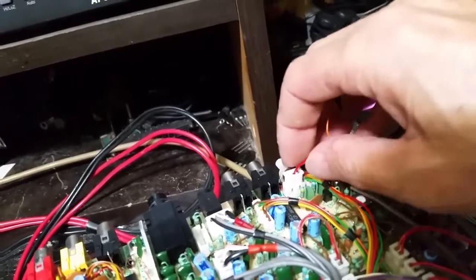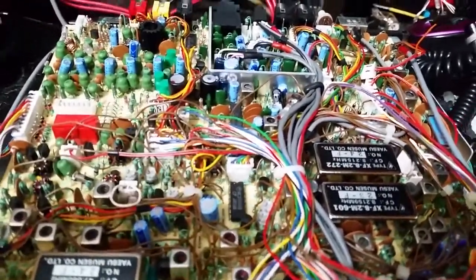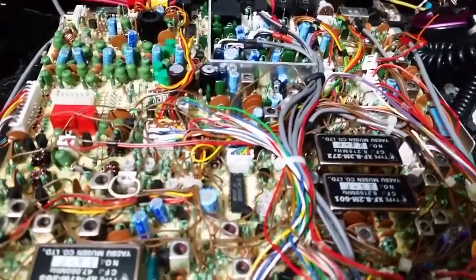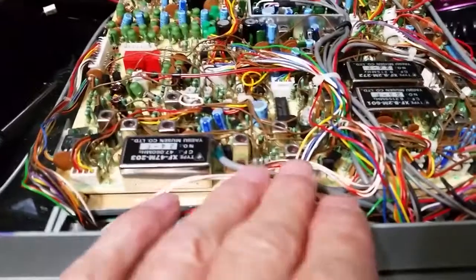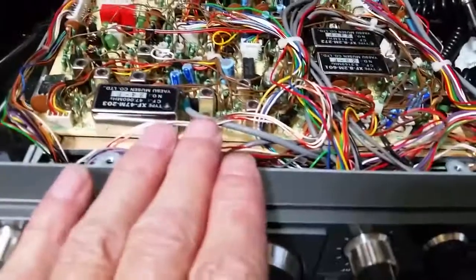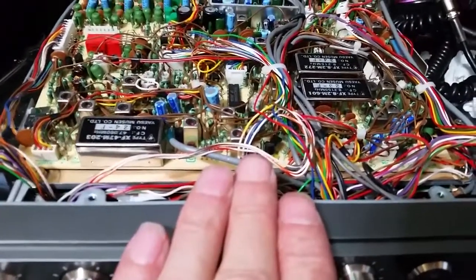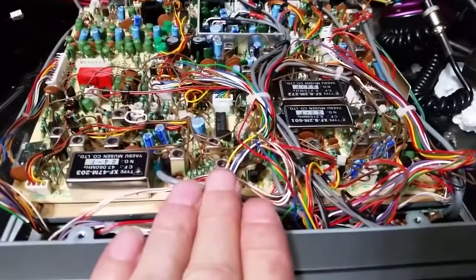You'll have all kinds of power — she'll do upwards of a hundred watts, well over a hundred. But now you have no control over output power. These radios have control over CW, AM, and FM power, but by design there's no control over sideband power, which really sucks if you're going to drive it into an amp. So we want total control of power.